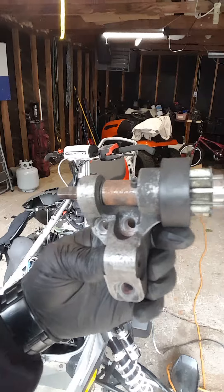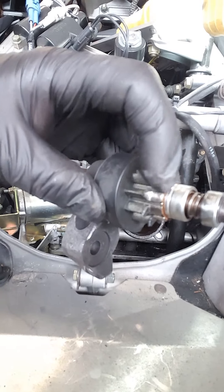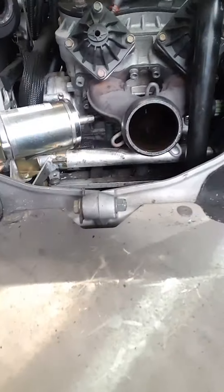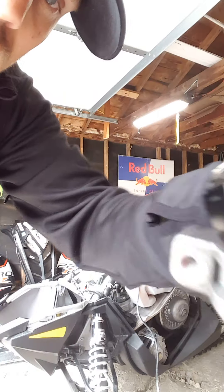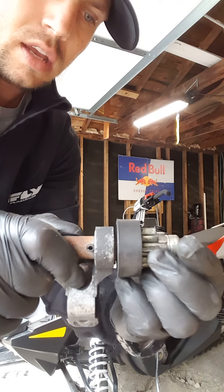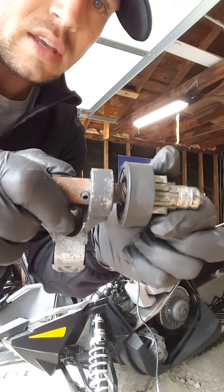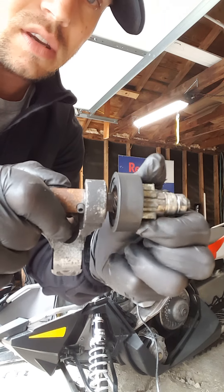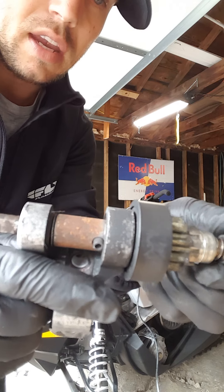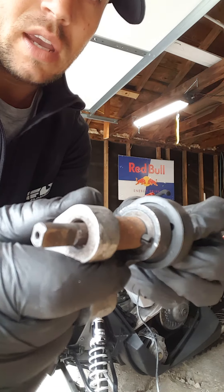On our old one we had some burnt-off tips from poor engagement, but the actual issue was inside. If you take this, it should only go one way — it's natural to spin it one way and it comes out. There's a worm gear on that shaft and that's what kicks it out to engage, and a spring forces it back. The problem was that when we actually spun it, it went the other way. You could spin this but the shaft wasn't going — and it should not do that.